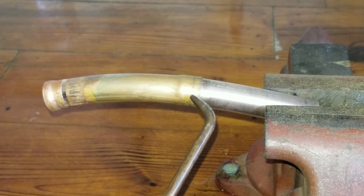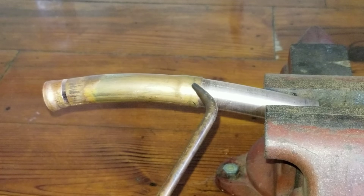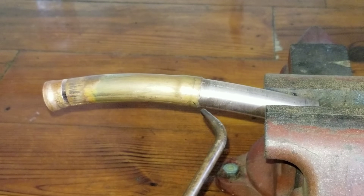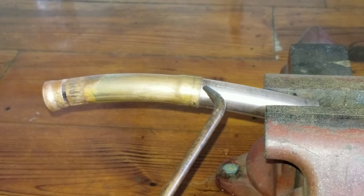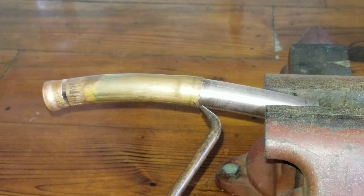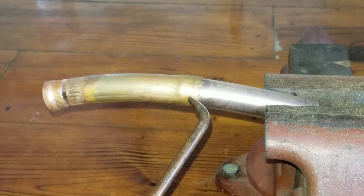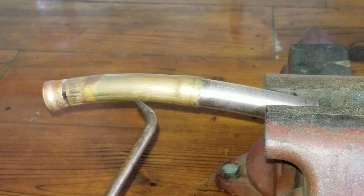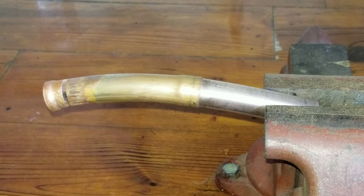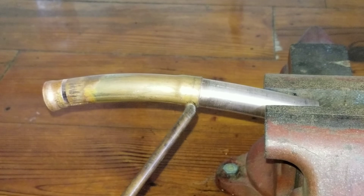So I'm going to heat this up, then I'm going to heat up the outside of the swage — or if it was a coupling, whatever, same thing. Once they're just about to get slightly cherry red, I'm going to try to drop a little piece of braze just up here at the top. And once that starts liquefying, I'll go ahead and start putting my braze on there. I typically use the brazing rod pretty sparingly and just walk it around. You want to make sure that you don't cap the braze joint — you want to make sure that you're getting that wick effect and you're pulling that braze back into the fitting.